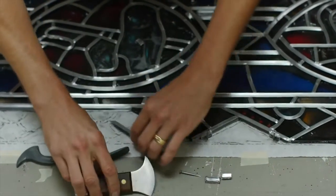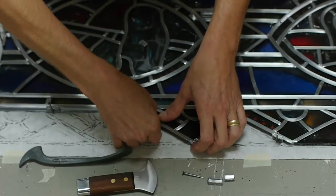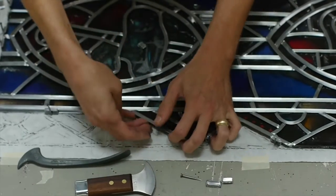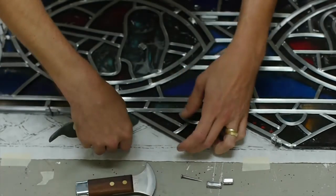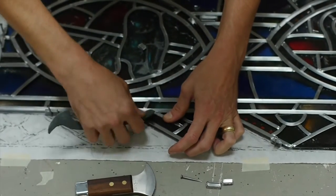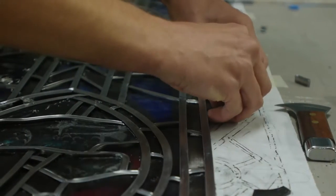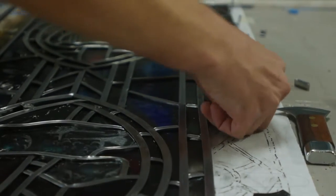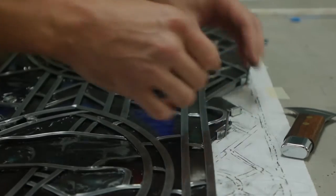The overlapped leads are a characteristic of German-made windows, so we will reassemble the windows using the same leading techniques, where we tamp down the ends of the leads and they can be overlapped with the crossing lead to make a much stronger window. You can see here that the leads are standing up very high. After the windows are cemented, another tool will crimp the leads down to the glass, which is also part of the original German technique.